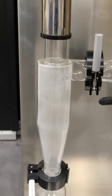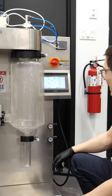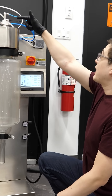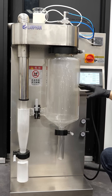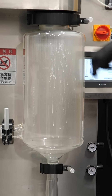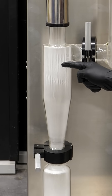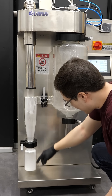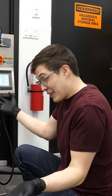Whoa, that's fast. So I should probably say what this is doing. Basically, it's just taking the milk through the tube, going here, and spraying it into this chamber with hot air spinning around, which almost instantly dries it, and then the powder gets shot into here and gets forced into this container. So what's this machine called? A spray dryer.